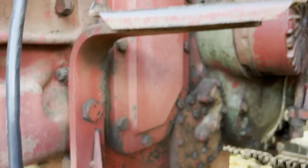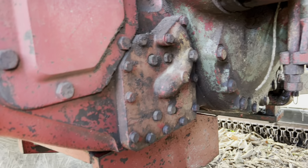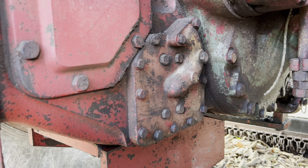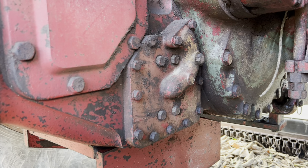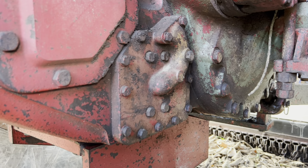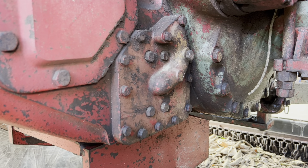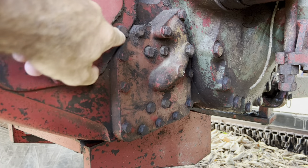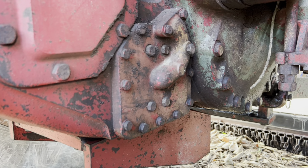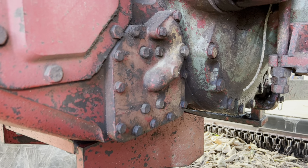I have changed the filter on the other side, but in here is the actual pump for the 3-point linkage. There are O-rings in there and once one of those O-rings is perished and lets go, it bypasses oil. So I'm going to try to pull this off, see what we can see inside, hopefully not cost myself more money, and see what we find.